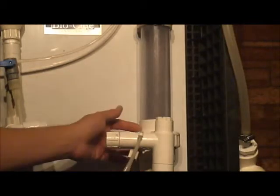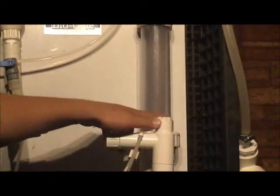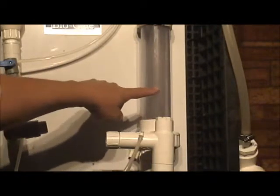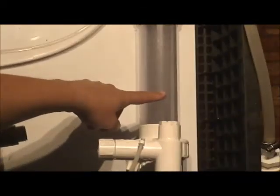You can see a shaded area, it's circular there. That's your center tubing. When the acid and the sodium chloride combine in here, it really is an interesting sight, because you literally can see the color change. It turns to yellow or gold, and then it moves up that center tubing as the water flow rate goes through it. You literally can see that concentration move up the tubing until, voila, it comes out the very end of the mix chamber and feeds into your water stream that's passing by up here at the top.